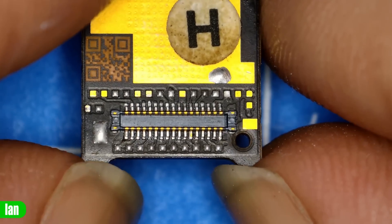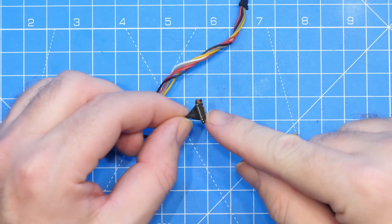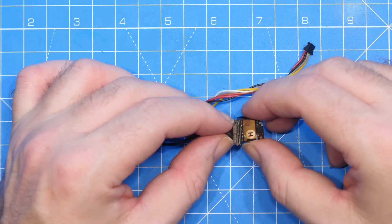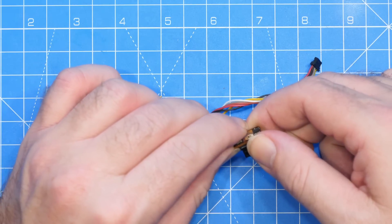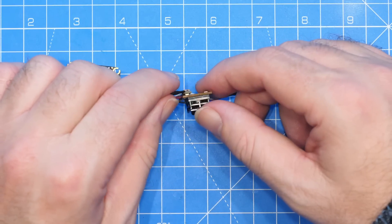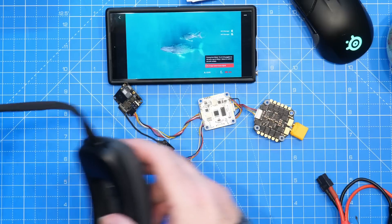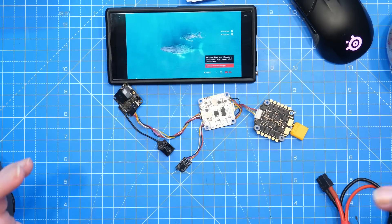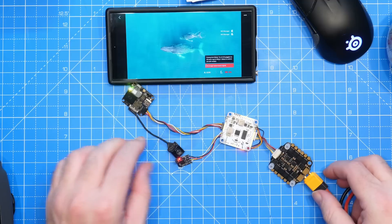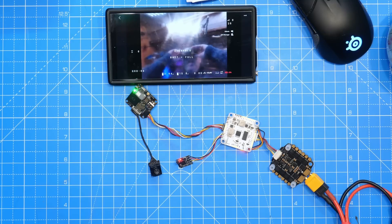For reassembly, I've put this side back together and put the interposer board onto the camera cable. I'm now going to try popping this on — it's the first time I've done this, so let's hope it fits. Give it a gentle push — that snapped on nicely. So we definitely got the right connector. I'm ready to test. I've got my goggles and my phone to see through the fly app. I'm going to plug in and look through my goggles.